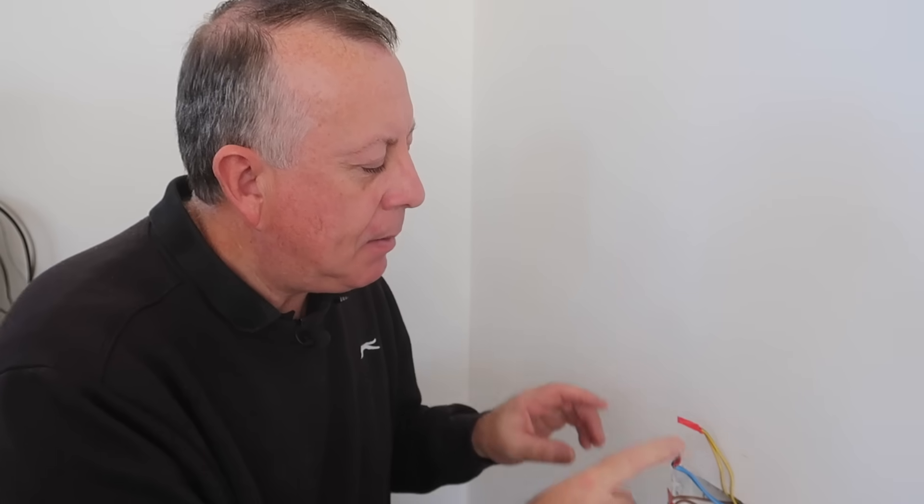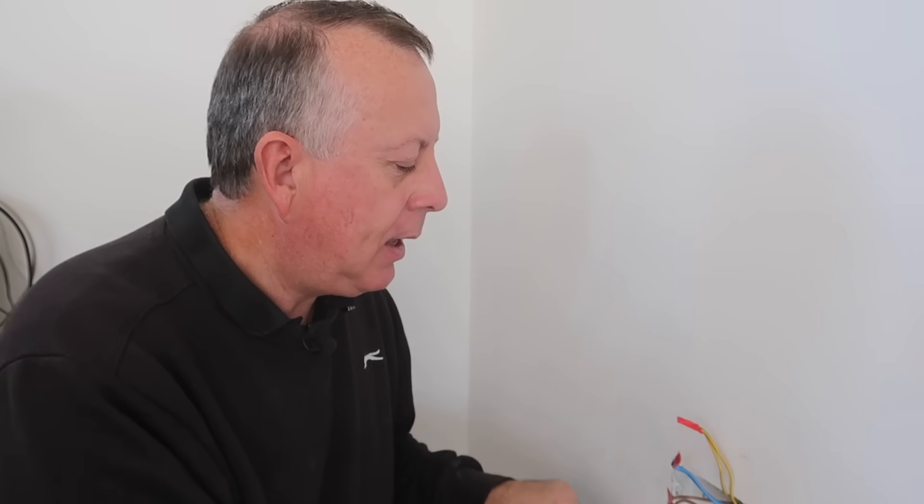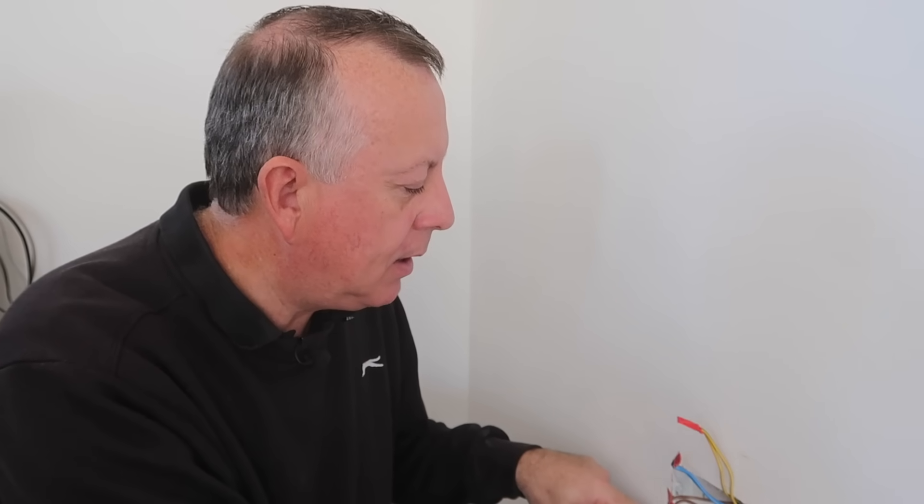That changes a couple of things. Rather than just pushing the cable through a void to meet the plasterboard on the other side, I'm now going to have to drill a hole through the masonry for the cable. And instead of a lightweight plastic back box that clips to the plasterboard, I'm going to have to replicate this and fix a galvanized back box recessed into the blockwork, which means a bit more drilling and maybe some chisel work, then plastering it in and making good around the perimeter.